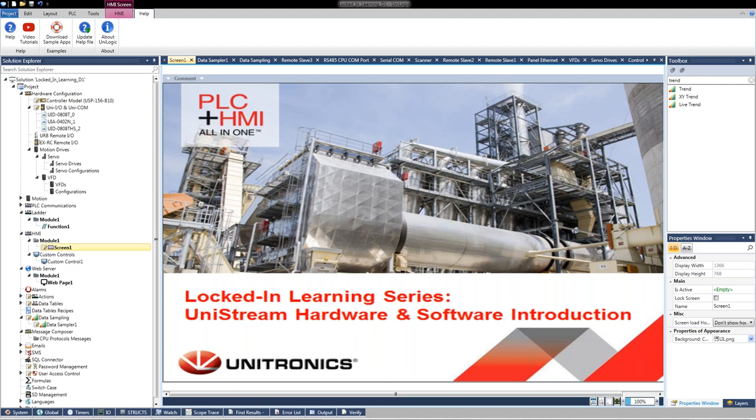Does the Unitronics mobile application also work with UniStream models? No. You can use any VNC application, so you do not have to use our application on the App Store. You can use any VNC application for UniStream. When we use VNC to connect to the HMI, it's just the same IP. It's the panel IP address, and it'll connect.